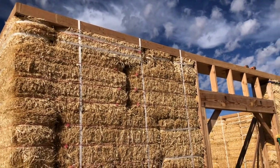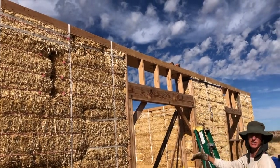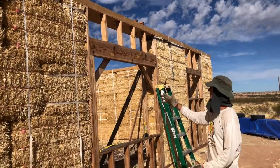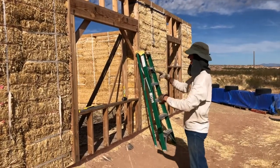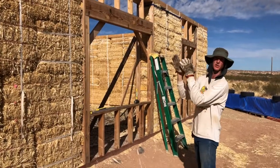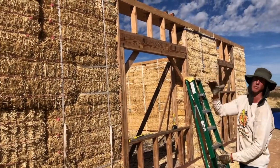Yeah, I remember. But now I do have it all the way down, but it's not enough just to touch the buck, right? The buck has to be plumb, so that the window is nice and plumb and square and all that, right? So I have to be careful about where I actually attach the box beam to the bucks. So I just don't want to attach it wherever it falls. And sometimes if the wood got a little twisted or warped, it lands in kind of a funny spot, or it's a little bowed.